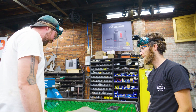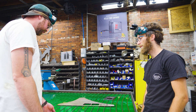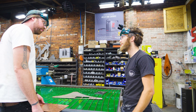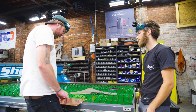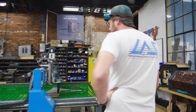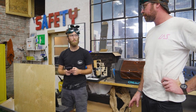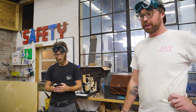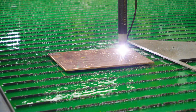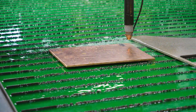I think we try quarter inch steel settings, and I think it's actually going to take more heat than quarter inch steel. Do you want to do an 85 amp tip or a 65 amp? I'm going to do 65 for now — we've got three more tests. So now we're going to use mild steel settings with a 65 amp tip, no modifications, just as-is. I can already tell you it's not working. Stop it.